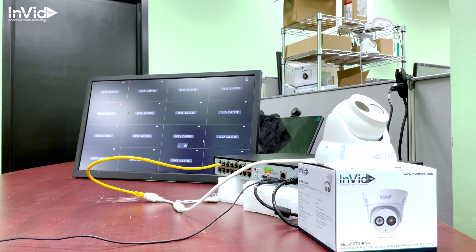When adding these cameras in, if you're using a short patch cable as I am right now, you want to make sure that you plug the camera directly back into the same port on your extended run that you're working with, because the camera will become a static IP address instead of DHCP. If it's not plugged directly back into the same port, it may not connect. It usually takes about one to two minutes to fully boot up and connect.